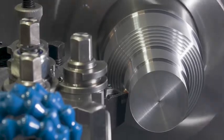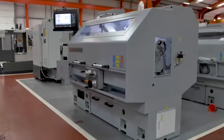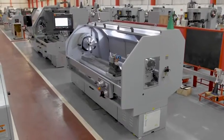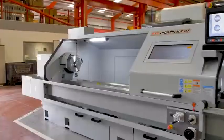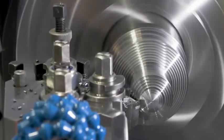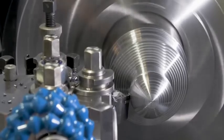The RLX 555 is a solid cast iron machine with one-piece bed and base and induction hardened ways. It comes in three sizes: 1m, 1.75m and 3m, and all come with a 104mm spindle bore and 560mm of swing over the bed. They all have a maximum spindle speed of 1800 rpm, and combined with constant surface speed, you have everything you need to produce components with a great finish.